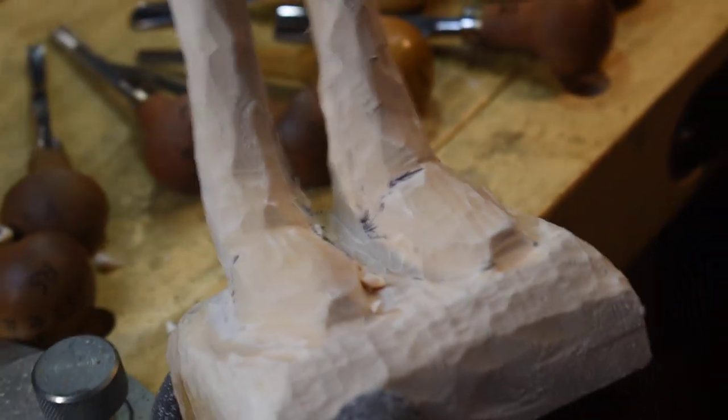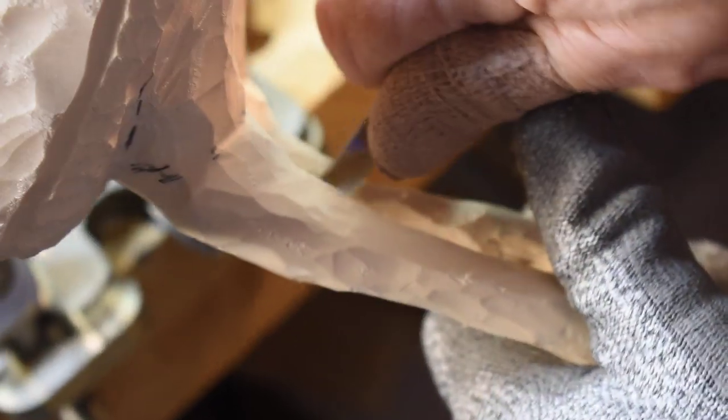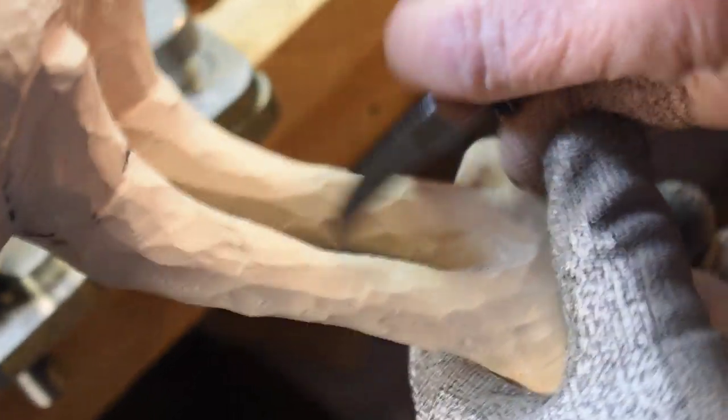I do see a little bit of a mark there, so I'm going to take my upsweep knife blade and remove these router marks. This is the beauty of the upsweep — you can come in there, it acts like a gouge almost, and you can shave it right down.